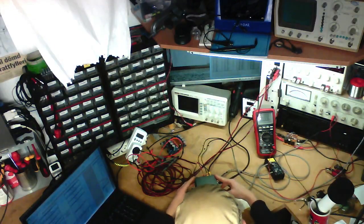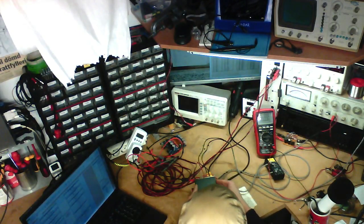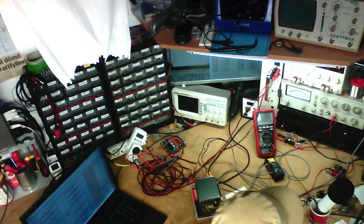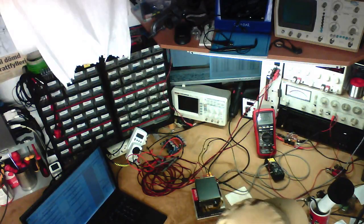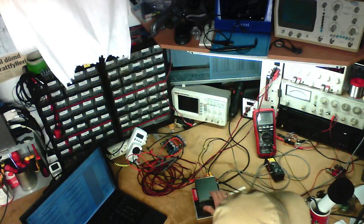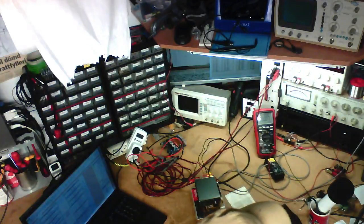Everybody's got laptop power supplies, and with the last generation's cheap Chinese Class D amplifiers, you were looking at the TA2020 based things like a Lepai, and those would go up in smoke if you connected 19 volts to them, so you were limited to like 5 watts per channel into 8 ohms. But this one will clearly do quite considerably more at about 21 watts.